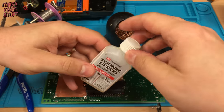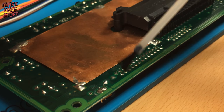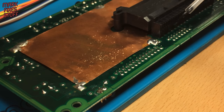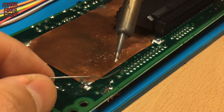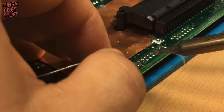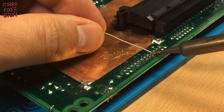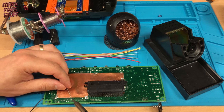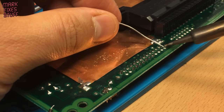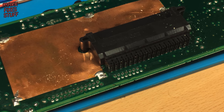Now we apply some liquid flux to the board. Flux helps by dissolving any surface oxidisation that might otherwise prevent the solder flowing onto the joint. This flux is the no-clean variety, so it doesn't leave behind any corrosive residue — if you wish, you can clean it off with isopropyl alcohol. I'm loading the required solder points with a touch of fresh solder. The flux helps the new solder blend well with the existing solder, reducing the time and heat needed to flow. We're using 40-60 leaded solder as well. Mixing unleaded and leaded alloys results in bad solder joints.